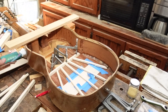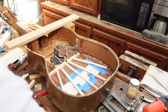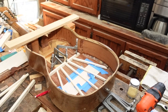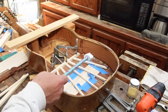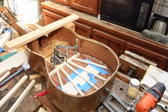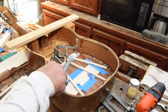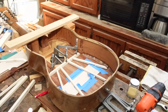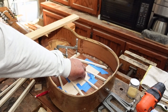We used the drill — once everything is lined up — to drill through here and here to give us those pilot pins. We taped that down, then used the marks we had made on the side of the body and cut each of these braces to the angle where they matched up to the cross brace — some of them straight, some of them angled — then tapered and rounded them off. Then we marked them for the thickness of the bridge plate and cut out the appropriate notch. Let's take a look at that over at the bandsaw.